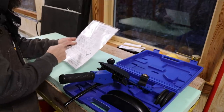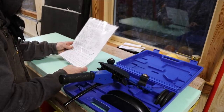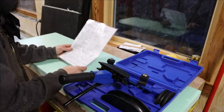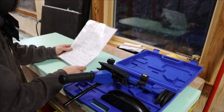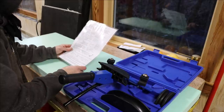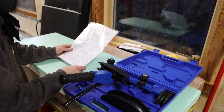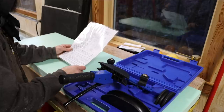Let me read you the instructions that come with this thing. I think you'll quickly realize where it's from after I get done reading this to you, if I can read it. Don't throw the bended wheel on the floor as to not broke it. The groove in the bended wheel and module should fit the pipes so as not to broke the surface of pipes. If the rack can't resist its former when loosening it, that is because the torsion spring lost its flexibility by tension, then change a new one. Bend the pipe slightly with hands, advance before bending pipe, and so as not as to put them into the bended wheel.